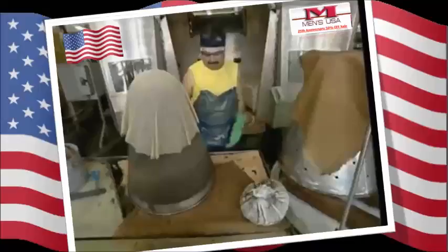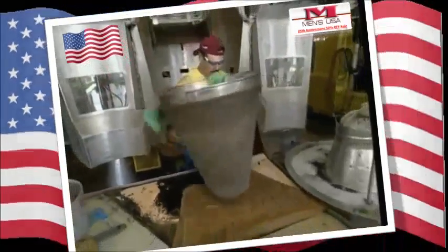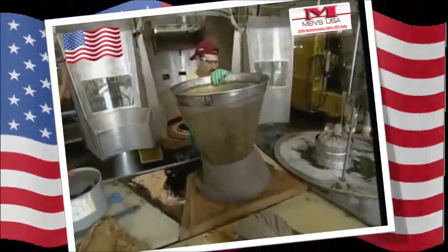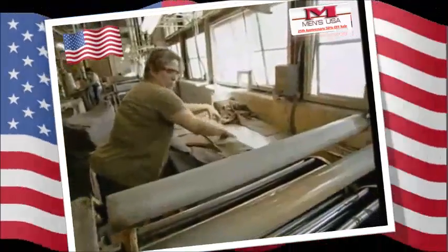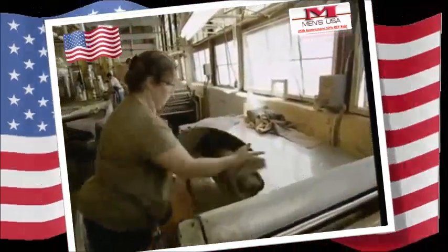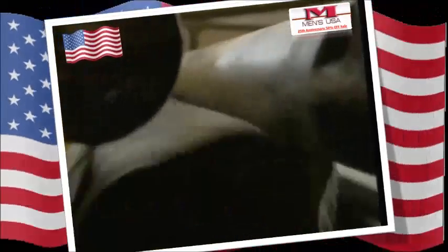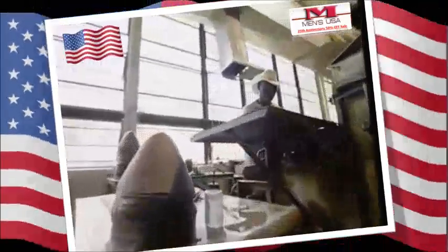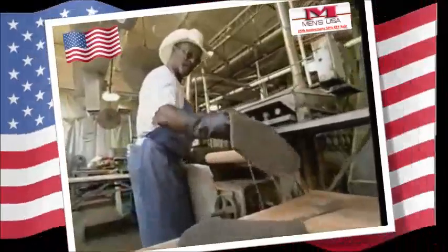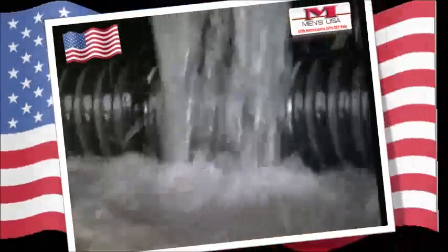At this point you've got an enormous cone — more Harry Potter than John Wayne — but it's still early in the process, so hold your horses. A cowboy hat has to be tough, so the fibers need to be well bonded. The cones are twisted into a cigar shape and placed on these rollers. The kneading, rolling motion will knit the fibers together. Each one is rolled and then bathed several times. By the end of the process, the material will have shrunk by almost 60%, but it still doesn't look very Wild West just yet.